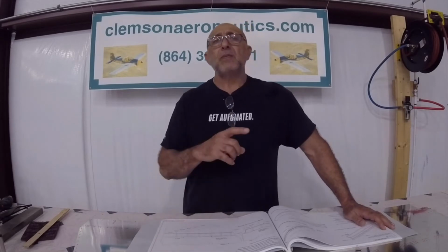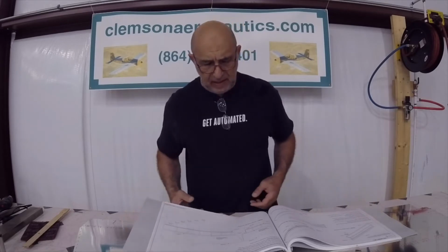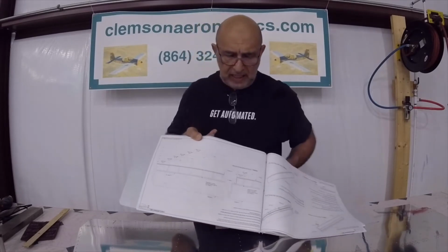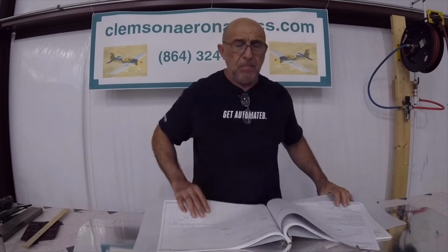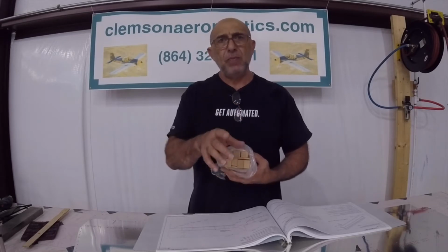The other problem is priming it. I cannot prime the part that I etched to put the Pro Seal on. So as I am etching, I have to bear in mind those places that are mentioned that have those ribs, and I do need to pinpoint exactly where those foam ribs are going to go. It's easily done. You can measure it and draw a line on it, so you can know to etch that part really well. But when it comes to priming, you need to cover it up where the foam is going to be. You need to cover that part with a tape so no primer would get on it.